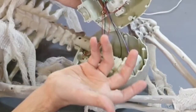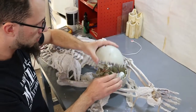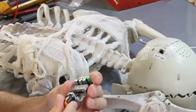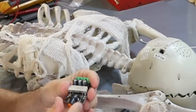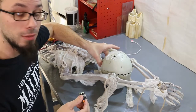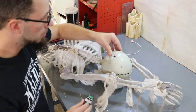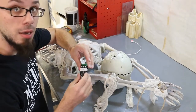It pushes the jaw down and then the spring pushes it back. The motors in here are three and a half volts, which is kind of tricky for a power supply — most people just get nine or 12 volt power supplies. So what I ended up doing was going online and getting some of these — this is a potentiometer. You've got your power and ground coming in and power and ground going out to your motor. This little knob goes from 0% up to 100% of power. So if you've got 12 volts hooked up at 50%, it would be sending six volts out. In an instance where we have a three and a half volt motor, we can put this to about 25% and put out about three and a half volts. Any kind of power supply going to any motor — especially when you're jerry-rigging something — as long as you pay attention to what current you've got coming out, you should be good.